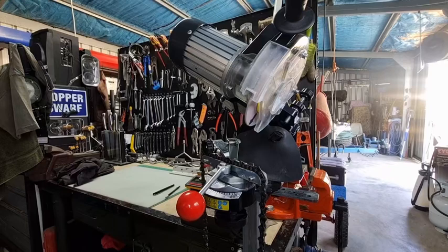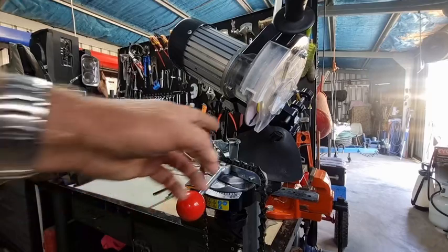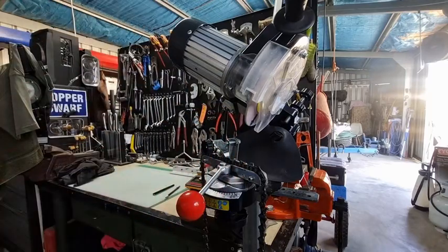I also tried it on a Husqvarna and a few other chains — it didn't take long with the grinder — and I found a little bit of variation: five, six, seven, eight percent. Eight percent was about the worst case scenario. So there's an eight percent difference between a blunt and a sharp side plate — about an eight percent reduction in cutting speed. Anyway, thanks for watching, bye for now.